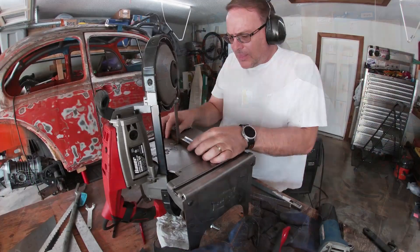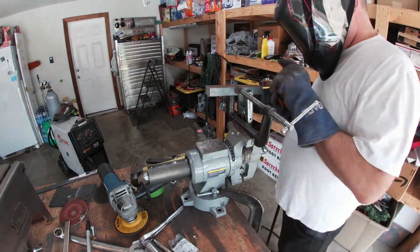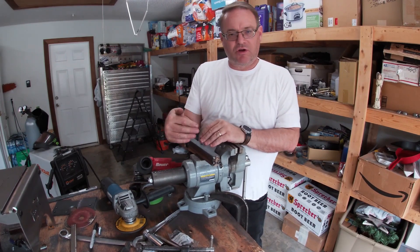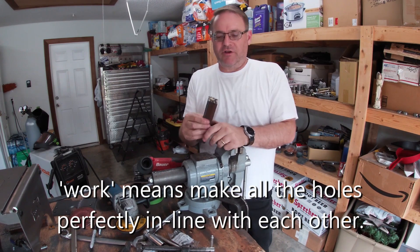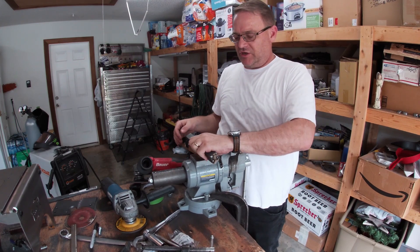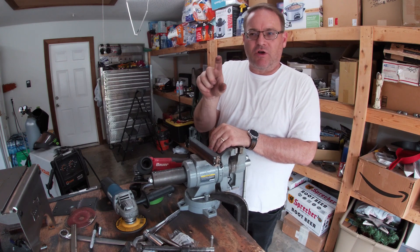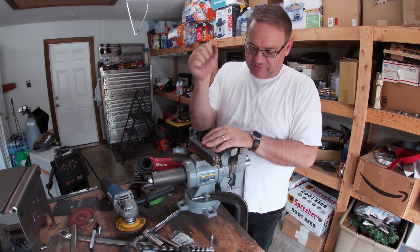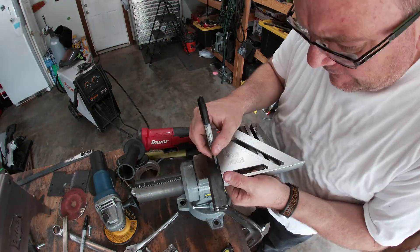So yeah, I rebuilt it. After cleaning up the bar and cutting it out I changed up my strategy this time: I put all the pieces together so I could drill them all at once. My big issue with the last one was the drill holes being ever so slightly off, which skewed the bolts just a skosh and they wouldn't fit into the rack. So I lined everything up on top of each other, tack welded them all together so they're one big chunk. I'm going to use a larger pilot hole so small weak drill bits won't wander or walk as I drill. I'll go a little slower this time as well. Step one: mark the holes.